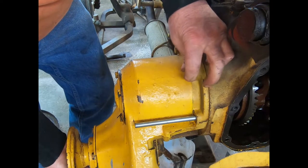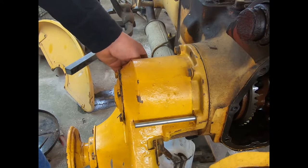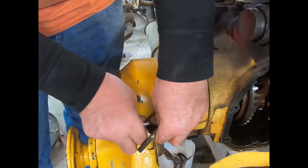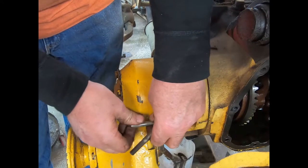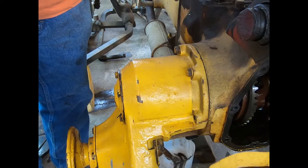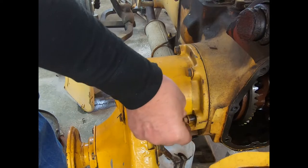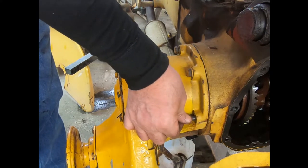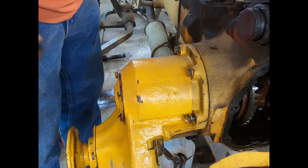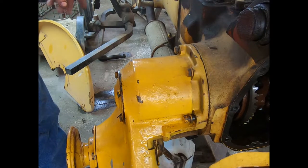If you don't normally use long bolts for lineup, you're missing a handy trick because it saves wear on the seals when putting stuff in. If you go to someplace like Tractor Supply and buy them by the pound, you're talking a dollar or so for a couple of bolts — they don't have to be grade eight. The two bottom bolts are shorter so those have to go in by hand. I missed one top bolt and didn't get it clean, so I've got to go wire wheel it and get the rust off.